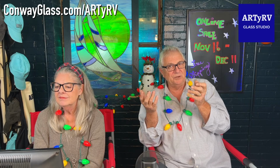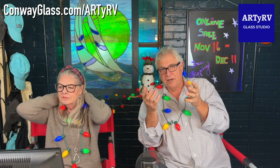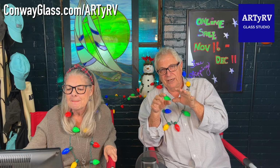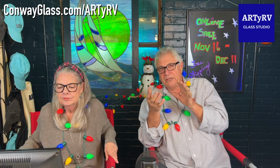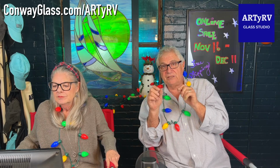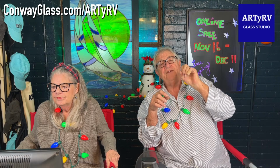So the normal everyday cracks that you're going to find are going to be in your borders. Most of those are going to be horizontal cracks. And unless the glass is missing in a stained glass window, don't replace it. You're just messing with the structural integrity of the window. Now, if you're building a window and a piece of glass breaks while you're building it, you can't take it to the customer with a broken piece of glass in it. However, if you're repairing a window and it's just got a bunch of horizontal cracks, but only 2 or 3 pieces of glass that actually have holes in them, fix the physical holes only. Leave the other pieces of glass.